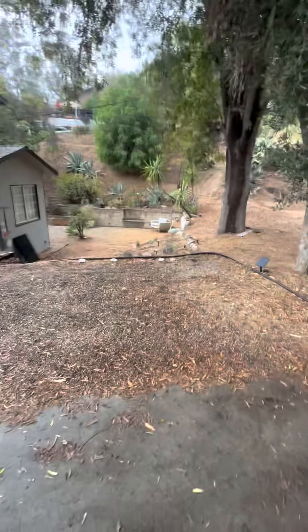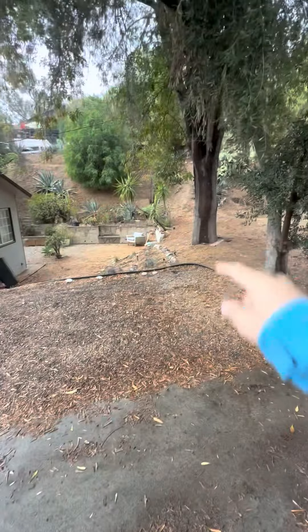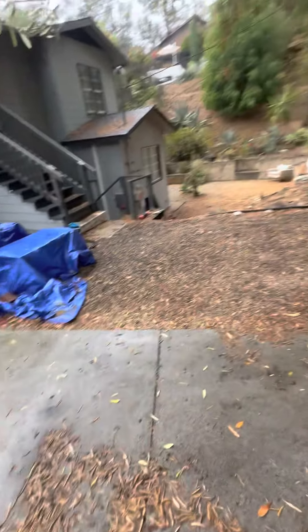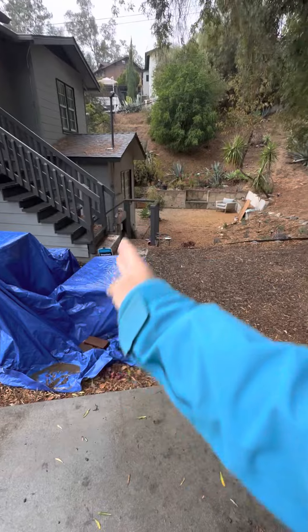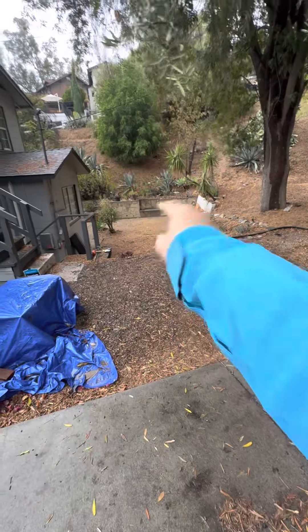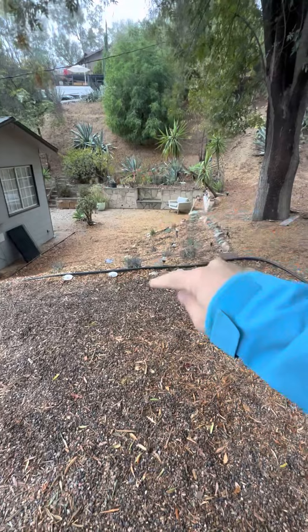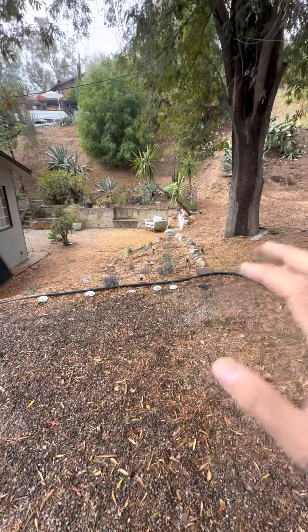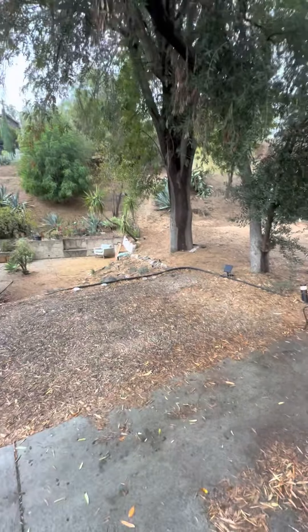As far as I can tell from the plans, the carport is going somewhere in here. What I can't tell is how close to that tree we're getting. The plan shows all the elevations, but it doesn't really tell me if we're coming out like 10 feet from the edge of the house — which would put it somewhere even with that little scoop-out seat area — or if it's wider than that. Regardless, if all we're doing is putting in a few piles in here, that shouldn't be a problem for the ash tree. We might end up seeing a few roots, but if we have to do some damage to some of the roots, that shouldn't be a problem.